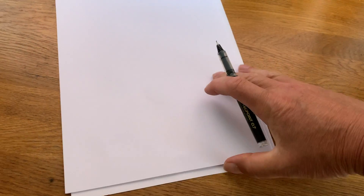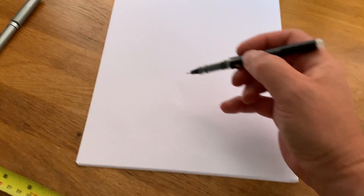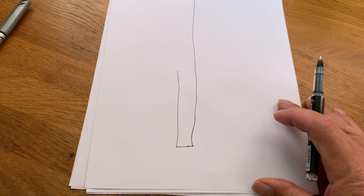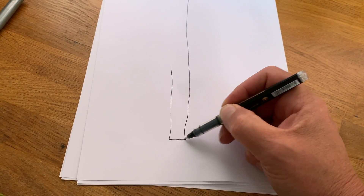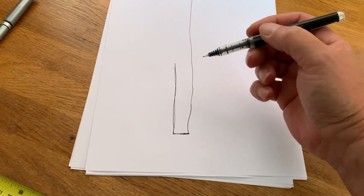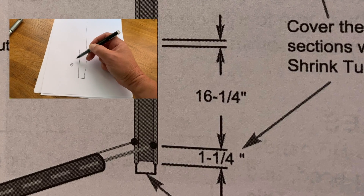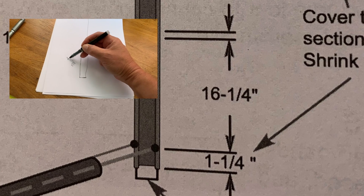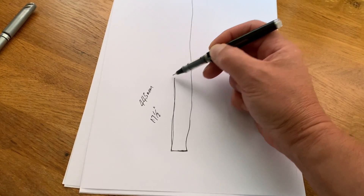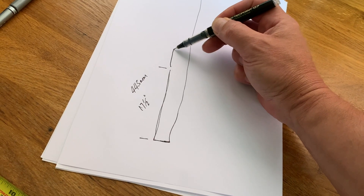Let's quickly draw this so that one can understand, and perhaps it might explain the reasons why we're putting certain things in play. So here's our ribbon cable, or window line, or ladder line. We've shorted the base and made the J-pole return leg — the bottom of the J — on this side, which needs to be 17 and a half inches, or in metric 44.3 centimetres, from there to there. That's where the first cut of a quarter inch, or 7 millimetres, occurs.